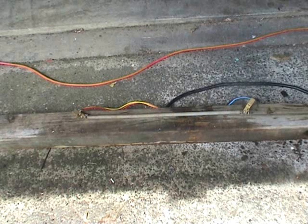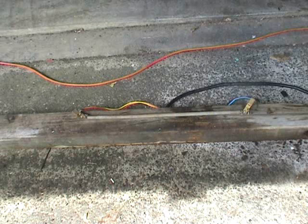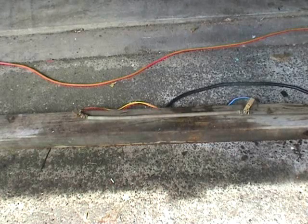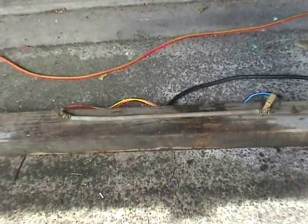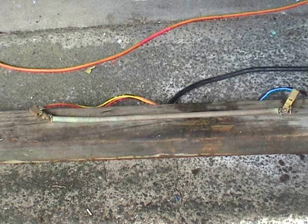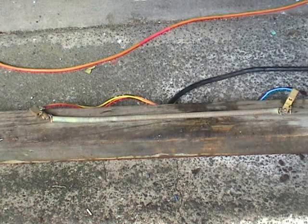Not picking up current now, just turning it back on. About 50 amps going, so this one at 24 volts is about 1.2 kilowatts. This is just a spring from the old couch as I said before. Let's see how well we're going to glow it. You could use a couch spring as an electric heater basically, as long as you have a transformer on it.